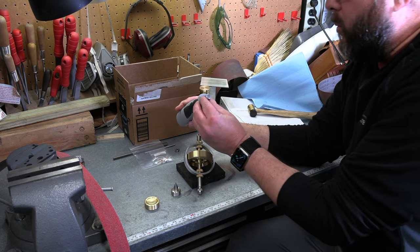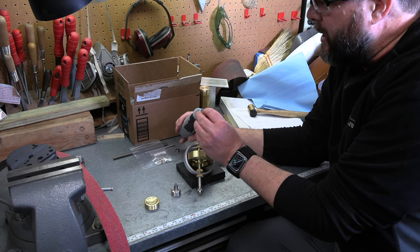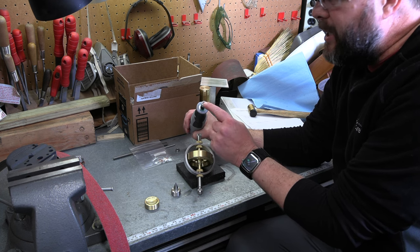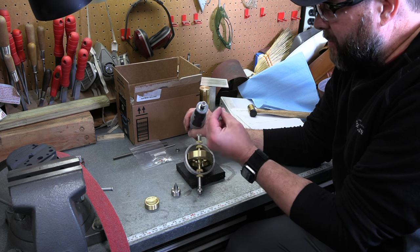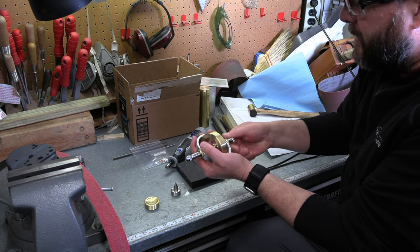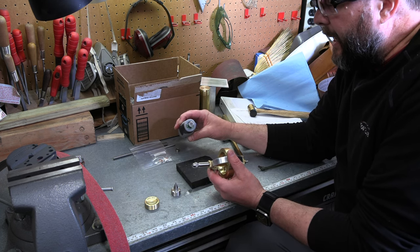Also, I worked on our starter nub a little bit. Instead of that black rubber that I was using, I bought some silicone tubing that's 3/8 outside diameter and 3/16 inside diameter. And that works way better on the shaft. The black rubber was just starting to deteriorate, get a little bit gummy, and getting some rubber powder all on our pieces, where this one, just super easy. Just cut a new piece, shove it in there, and it works great.